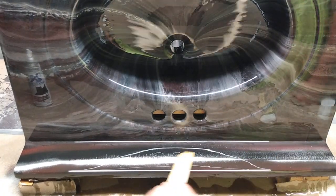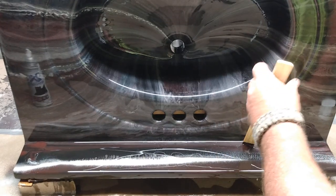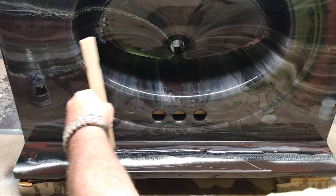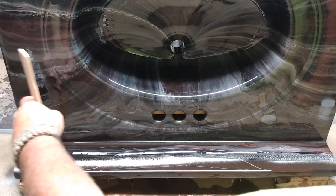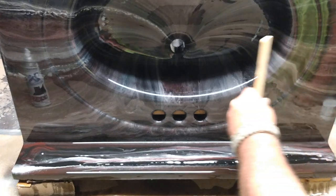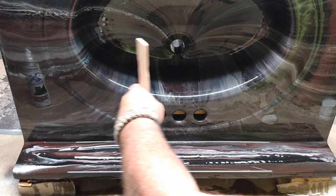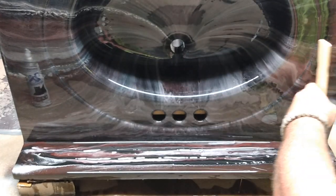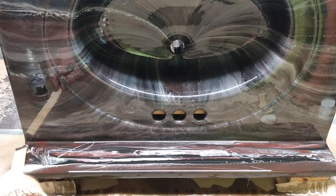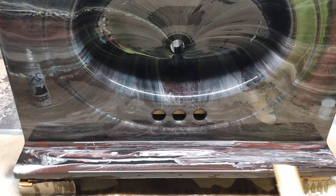Take your paint stick and just start working it from side to side. You can take your paint stick and kind of turn it sideways like this, and it will roll that epoxy with that color in it like a plow in the direction that you want it to go. That's just a little trick to get it where you want it.